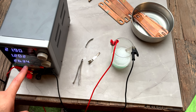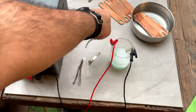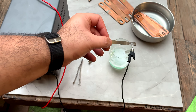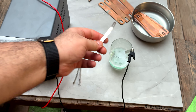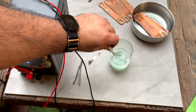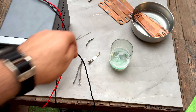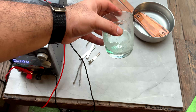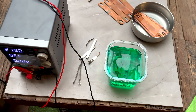It's been a few minutes. I added some more salt and it's now drawing a full amp. You can see it's starting to get the color we want. I'll pull this out — you can see the anode has been sacrificed and there's some deposition on the cathode as well. It does form a little layer there. If you run it with nickel strips you get something like this, and if you let it run longer it will turn into a highly saline nickel solution like what I have over here.